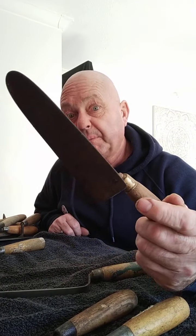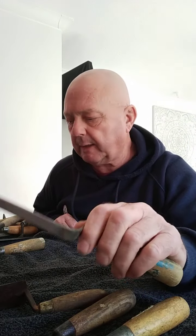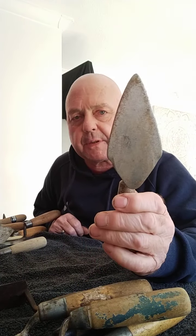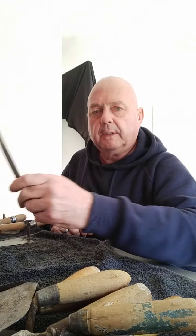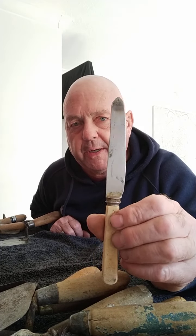Yeah, for weather pointing. Big weather pointing. I've had that years. German one that. Perps. Dotter for your perps. Pointing trowel. Big pointing trowel. Little one. That's a Frenchman. And that's when you're doing weather struck pointing on a straight edge, and that's what you cut it off with.